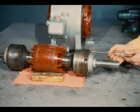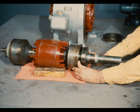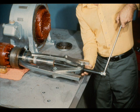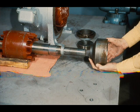The next step in the disassembly process is to remove the screws from the bearing retainer, as shown. Then slide the retainer off the end of the shaft. Since the retainer is no longer holding it in position, the bearing cartridge may now be pushed back off the bearing, as shown here. Now the workman removes the bearing from the shaft with a bearing puller. You may use whatever method is preferred at your plant, but don't forget to protect the shaft center with a piece of copper or other soft material. Once the bearing has been removed, don't forget to label it according to its position in the motor — this is a very important step. The last part to be removed on the inboard end of the shaft is the bearing cartridge, which simply slides off as shown. Don't forget to tag the cartridge to record its position.